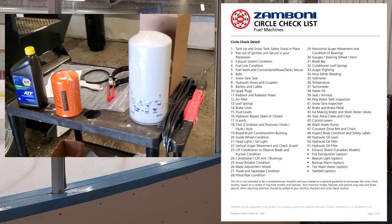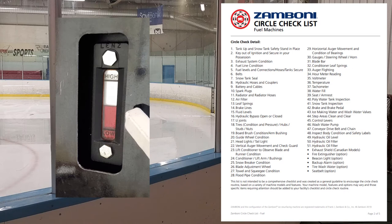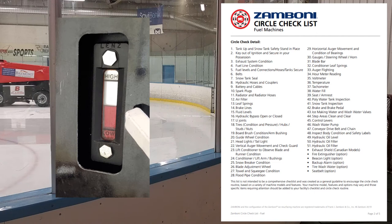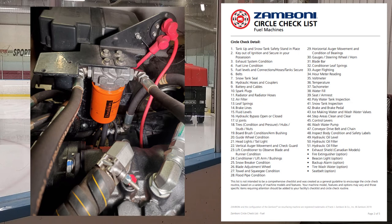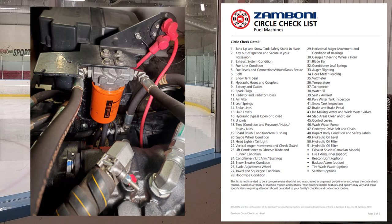Numbers forty-nine through fifty-one: hydraulic oil and hydraulic filters. Make sure you've got hydraulic fluid on hand and check the side glass — it should be about halfway when cold and near the top when warm. As for the filters, change them once a year to be safe, three years tops. I've been told different things but let's just change them once a year.